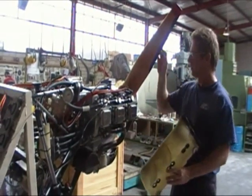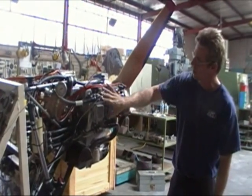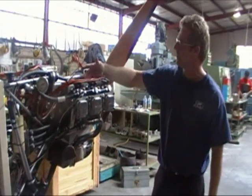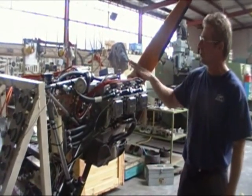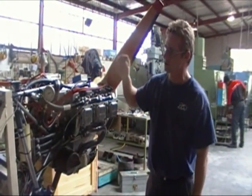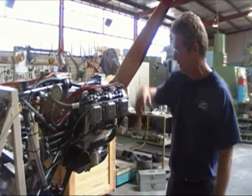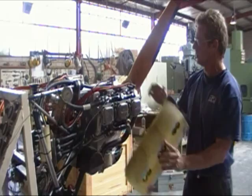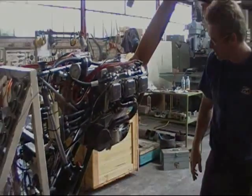Which I believe can't be right. We'll throw these in the bin. The way we expect it to work is liquid cooling in the heads, which will take all the heat out of the heads very efficiently, and the top portion of the cylinders. Then we'll have air coming through those openings, which will be allowed to ventilate and cool the six cylinders and of course the crankcase itself, and any other accessories such as the coils, starter motor, whatever. By putting those original ducts on your aircraft, technically you're not allowing any air to cool the centre section of the engine or cylinders — so we'll get rid of that.